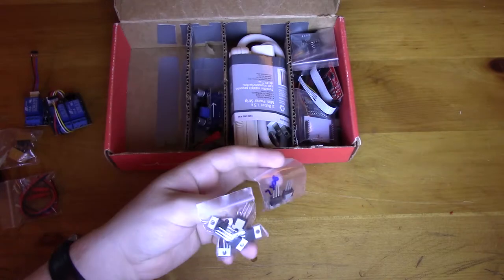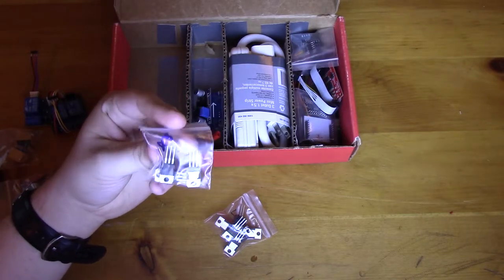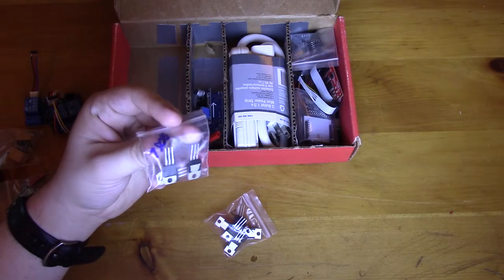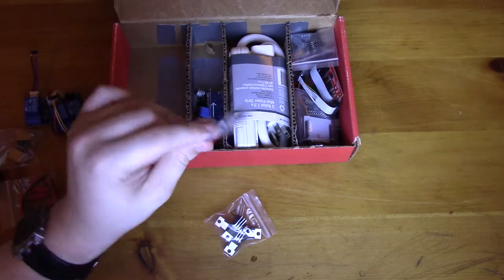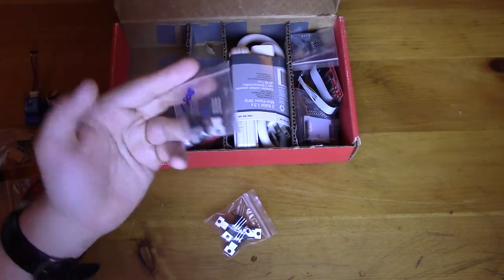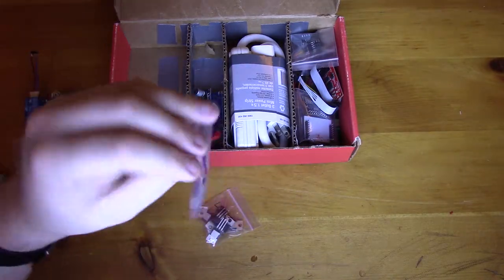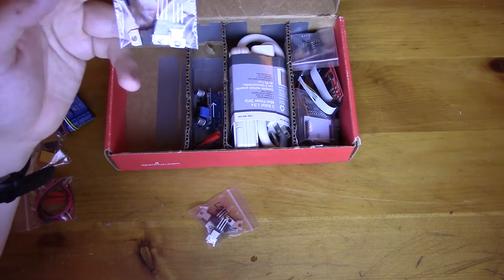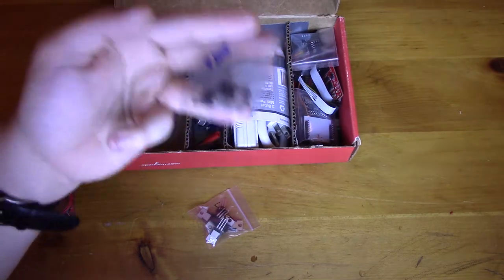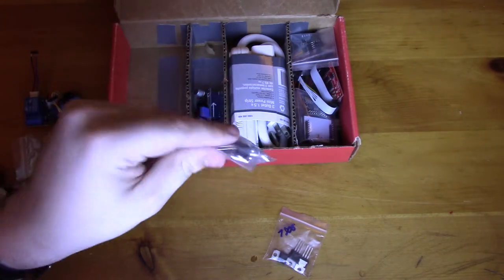Here I've got some linear voltage regulators — I got a few 7805s. The '05' is the voltage and '78' is the series number — one of the most common voltage regulators out there. They're fine when you need them. That's also why in a previous video I showed that I keep a heat sink on hand, because these will generate heat like nobody's business. They're rated I think either 0.8 or 1 amp, maybe 1.2, but not a whole ton of current — though half the time you don't need a lot of current anyway, so these work pretty well.